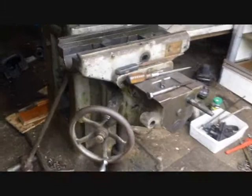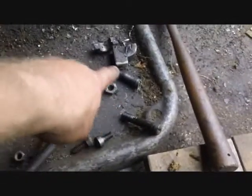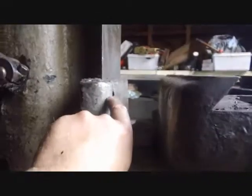Camera battery's dying and I'm sweating so I'll quit for today. But quickly — I just found out that these screws in the front of the knee actually thread into the jib behind it. I was lucky enough to get two of them out and could see the threads on the end, so there was no way I was going to bang on those thread ends like I thought. I've got one out on the bottom and one on the top. This one screw is giving me trouble so I'll have to come back with my impact driver and see if I can loosen it up.